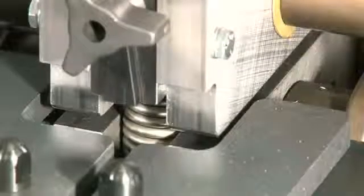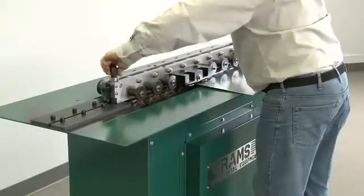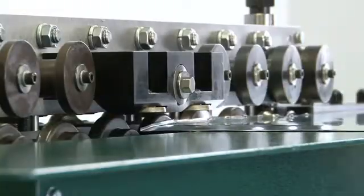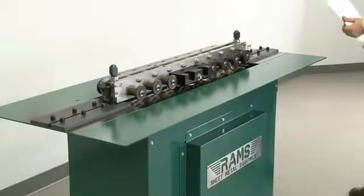As the jam bolts are loosened, the top plate of the gearbox lifts from the bottom plate automatically, with a little help from the operator. Once enough room has been created, the metal is easily removed and the jam is cleared.